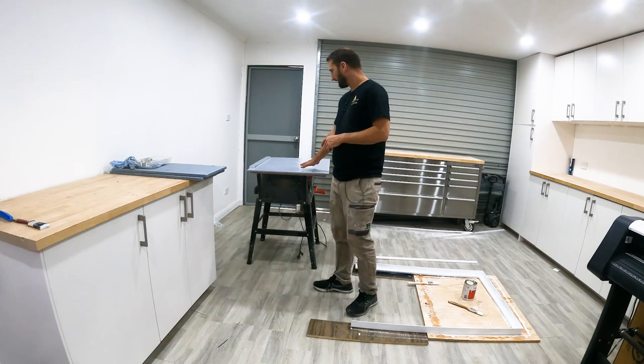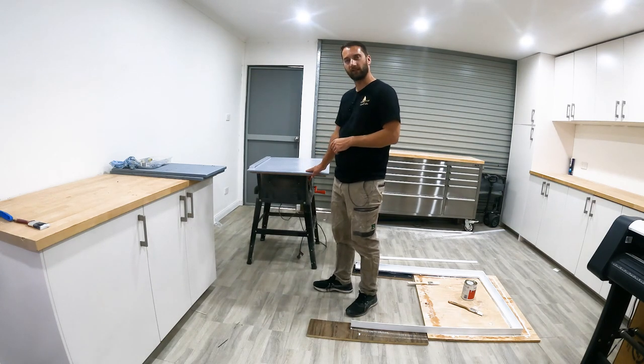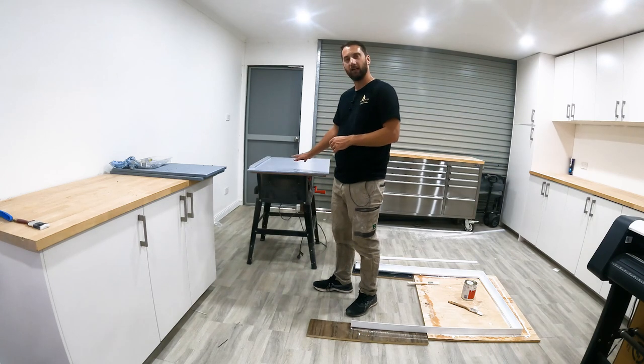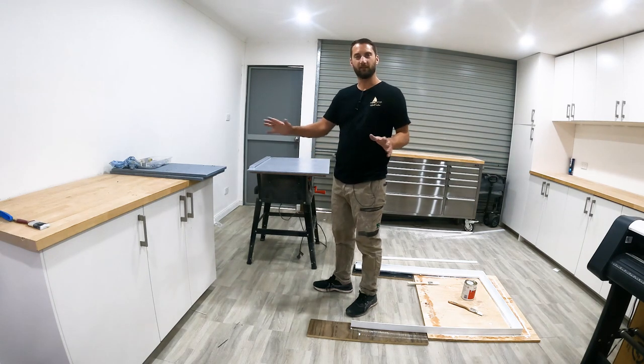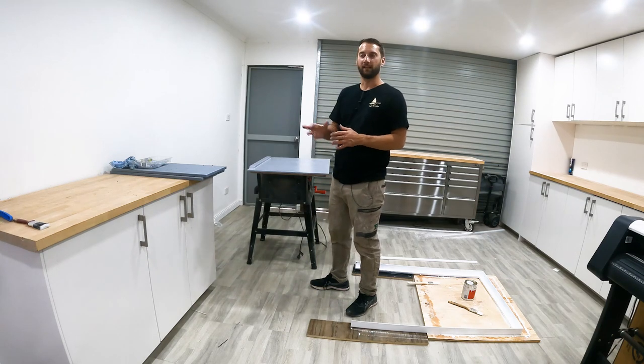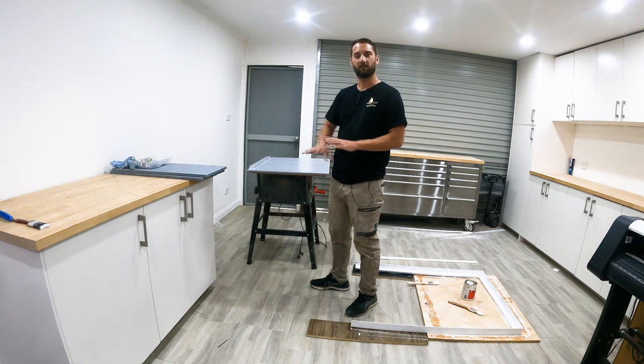And we've put an undercoat on the Companionway slide, so that's looking really good. I'm really impressed with how that's come out. I'm not going to paint that white now because I want to be able to paint that at the same time as I do all the other exterior of the paint. We don't want to paint that now. You buy another batch later and then you get two slightly different shades. I'm going to paint it all at once so it's all uniform and it looks nice and professional.